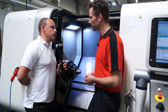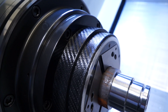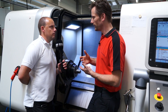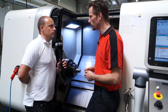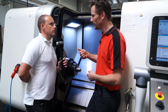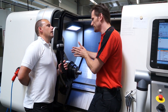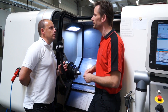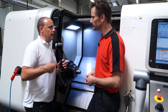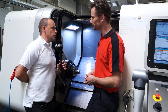So who would use it and why would you use a carbon fibre chuck? Carbon chucks are best when most of the mass rotating on a turning machine comes from the chuck. When you have smaller work pieces and you produce them 24/7, the carbon chuck might be very interesting because it saves energy and production time — you don't have to accelerate and decelerate as much weight. So the heavier steel chuck has to do that acceleration to get to your turning speed, whereas with a lighter chuck you can get there quicker.